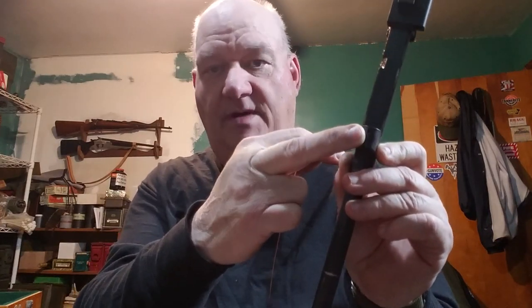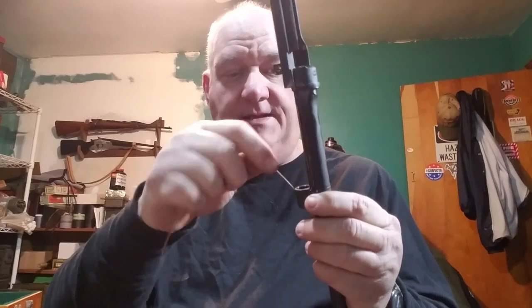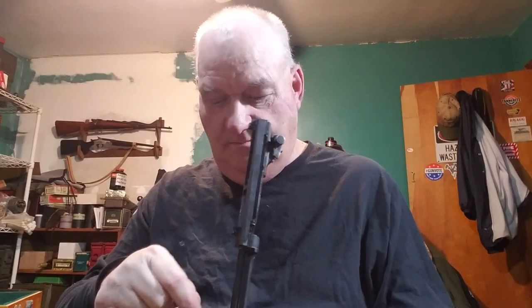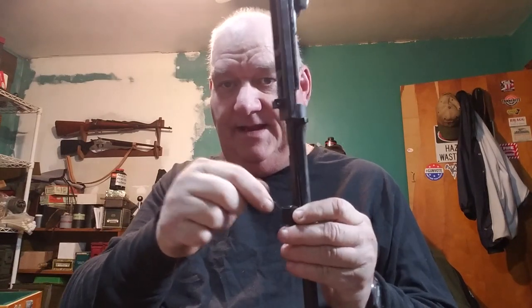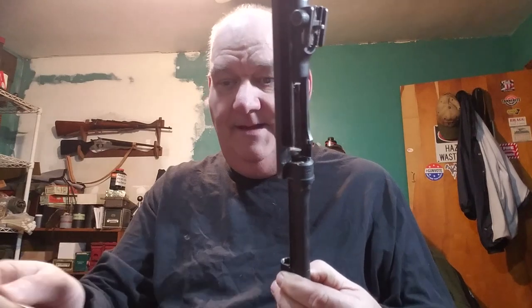This is a piece of .035 steel welding wire. On the bottom of a GI one there's a little inlet on the bottom of the lug, and you can go in that hole — it lines you up just about perfectly with the gas pickup and allows you to clean that guy out.